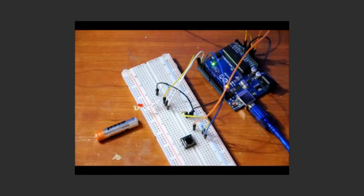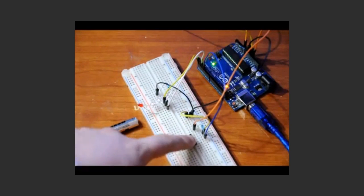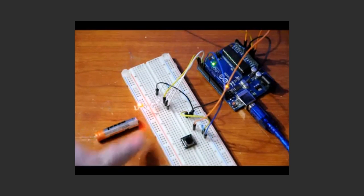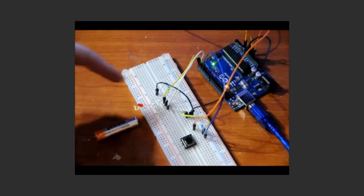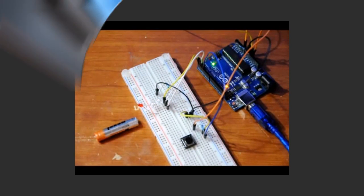Anyhow, Project 6 — the job is to make a simple battery voltage detector. If I've got no battery connected to this circuit, I press the button, it samples it, and tells me I've got a bad battery. There's also a yellow LED and a green LED. Green tells me that I've got a voltage over 1.55 volts. Yellow is between 1.4 and 1.55 volts.